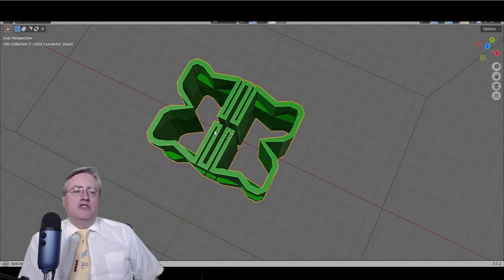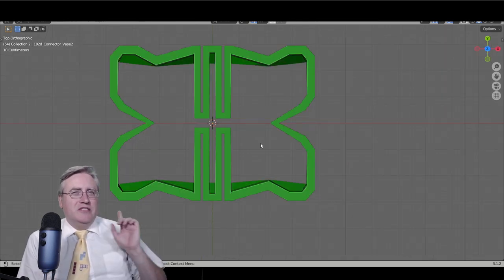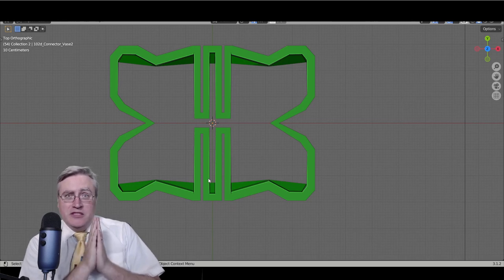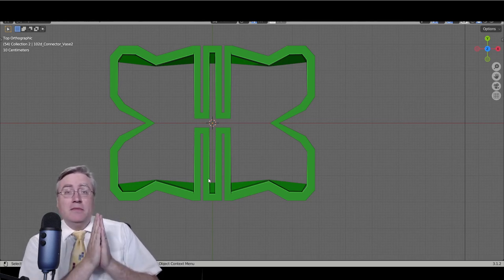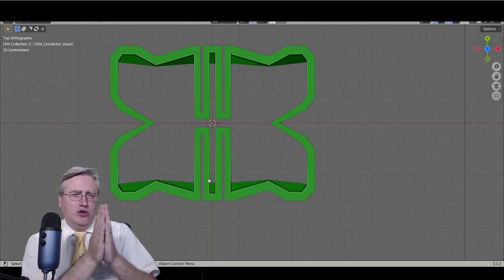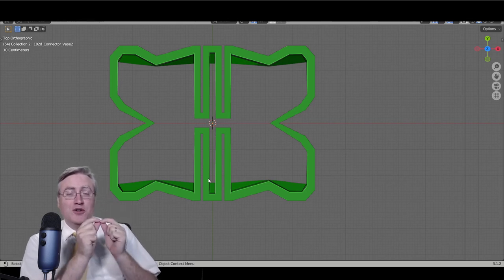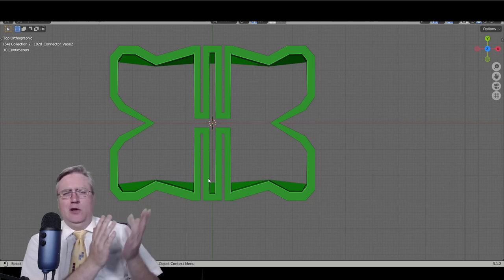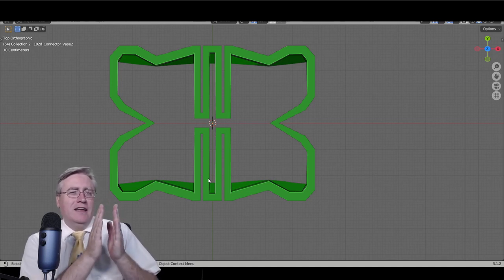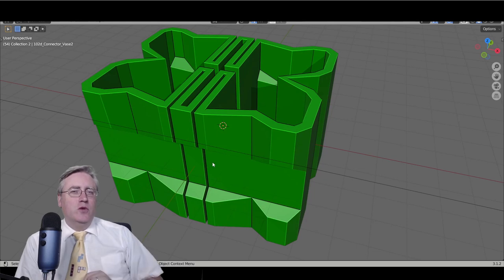What if I put some cuts into it so that as those walls go around, they build up and become a wall? It was difficult figuring out exactly how big to make these cuts because if the walls were too close together, some slicers would just make them disappear. I found that about a 0.02 millimeter wall worked, with the goal of getting them to stick together — close enough for the extruder that they would hopefully fuse. Unfortunately, in tests, this one didn't work. These connectors kind of stretched like an accordion.